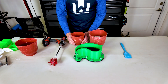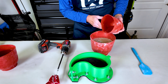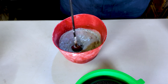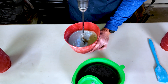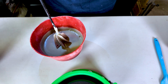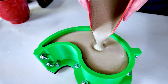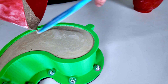It's time to mix. What I like to do is not pour all the water in at once — I'll pour about three-fourths of it in and then start mixing. Take the drill mixer, start slow so you don't make too big of a mess. The main thing is to get it all mixed in and get all the lumps out. Run it on the sides and make sure you hit the bottom well. I want this to be about pancake batter consistency. So now we just make a pour spout and fill up the mold — you just want to get it right to the edge. Take the spatula and get the rest out.